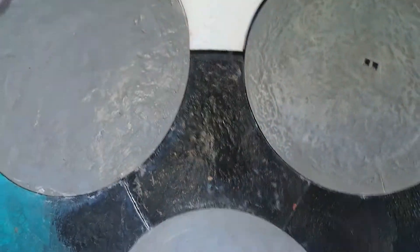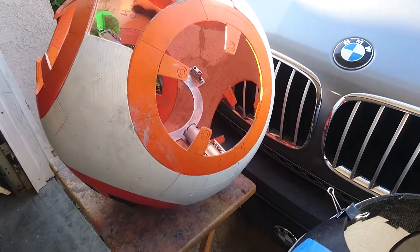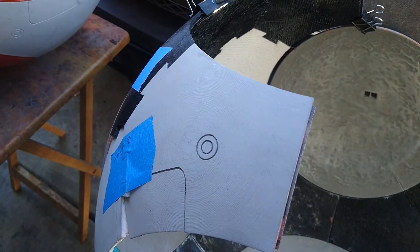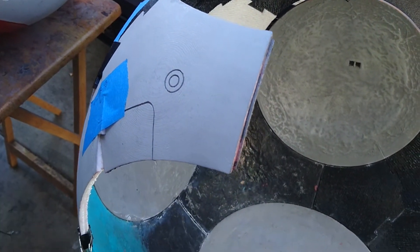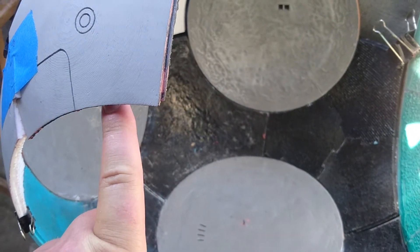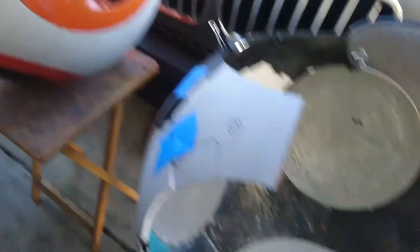But I just want to give you an update on that. So there's my original ball. The funny thing is I did some upgrades on the printer — changed some settings — when I was originally printing out the parts for these triangle pieces here. They're about a millimeter to two millimeters short because of the lead screws on my printer — I think it's the z-axis. But I fixed that and started printing this one out and it's come out quite well. The difference is, funnily enough, that this ball's inside diameter is 20 inches, while the other ball's outside diameter is 20 inches. So there's definitely a size difference — I can actually fit that ball inside this one.